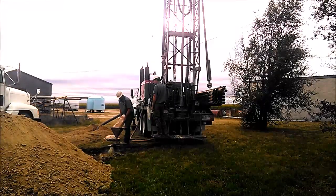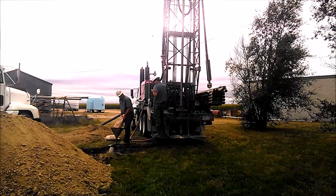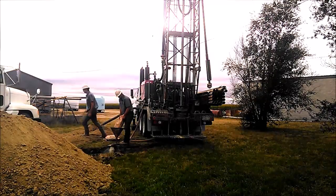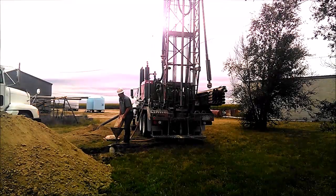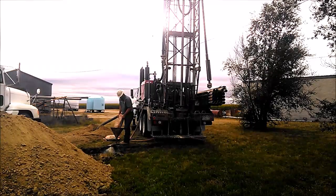We typically don't have too much trouble getting drill cuttings out of the hole. Our mud pumps are big enough and the uphole velocity is fast enough that we don't usually need mud for cleaning the hole. Also, we try to keep the mud pretty thin so it drops the cuttings out in the pit easier and it doesn't circulate as much sand through the mud pump.